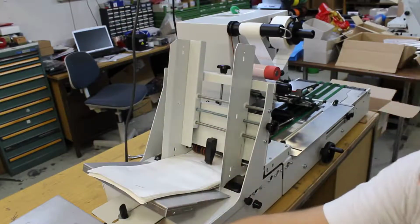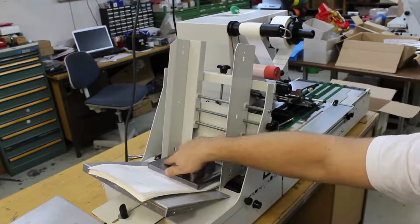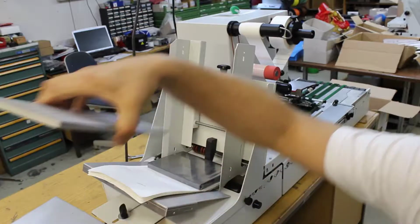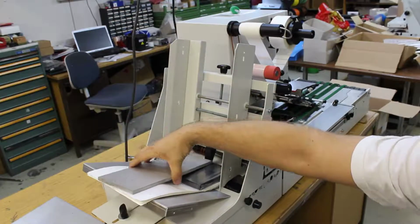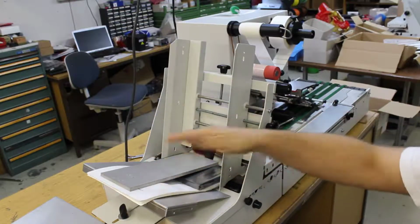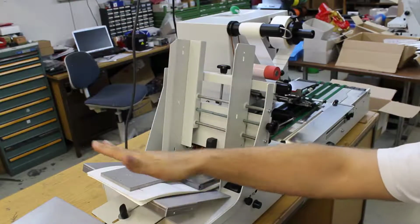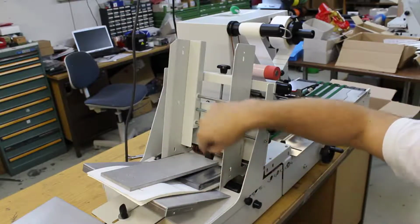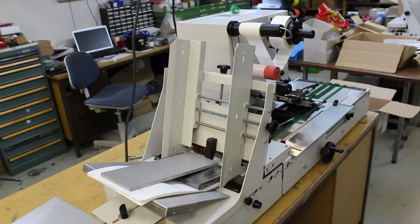Alright? We need to apply some weight because we only have 20 pouches. They don't have enough weight to cause the traction we need to pull down the lowest product. So we put a DVD box which has the same measures as the product itself and apply a weight. It's important that the weight is not completely spread over the product. It's important that it's at the tip, because here you have the conveyor belts and the ribbons which move out the product, alright?